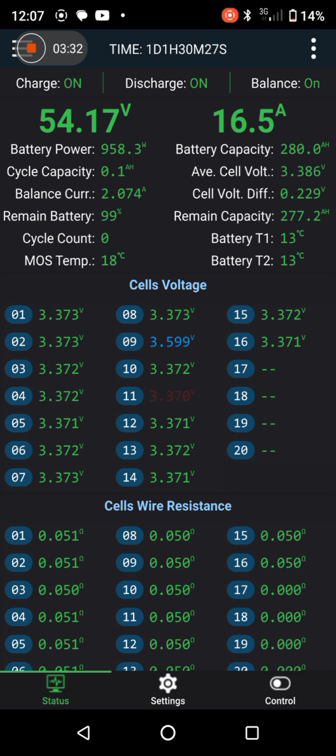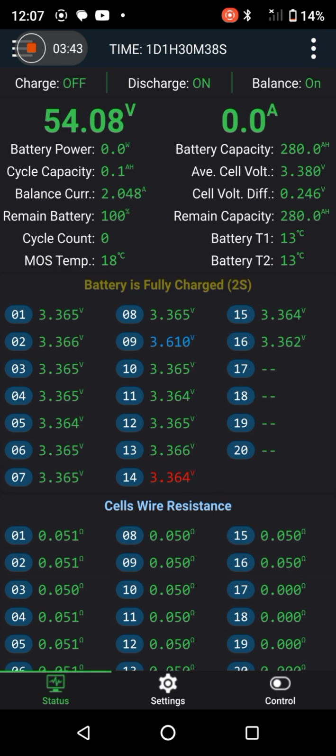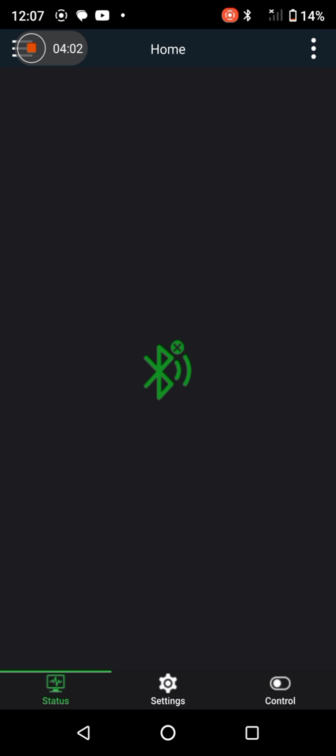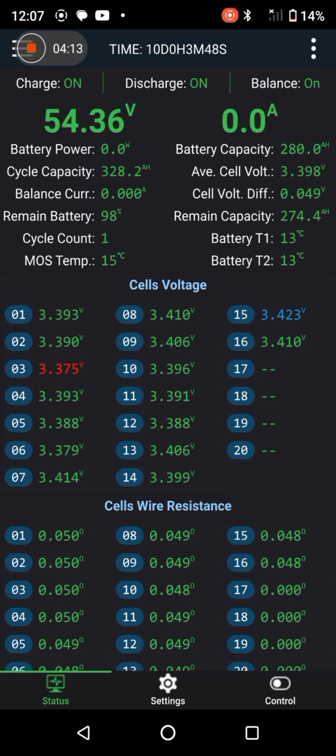So I'm going to go in, because I don't like that voltage delta from side to side. So I shall turn the inverter right the way down to 2 amps of charge current. And the left bank doesn't register the 2 amp charge.